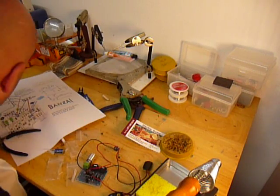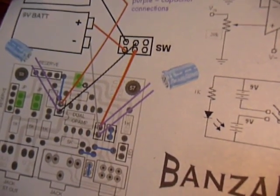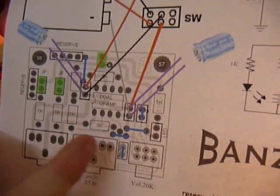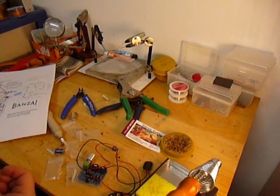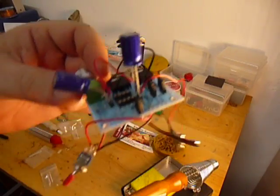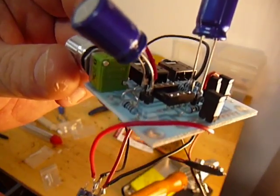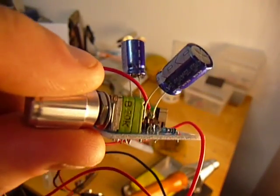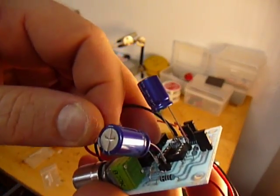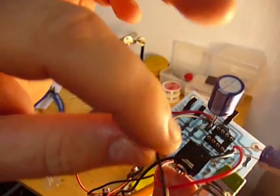On the diagram, it shows you plus and minus. You want to make sure the white bar on the side of the capacitor — that's the negative — so both bottom poles on this are negative. I'm going to add those now. You can see the capacitors have been soldered onto those jumper connectors. That white bar on the capacitor is going to match to your black lead on the battery — that's the negative side of the capacitor. Make sure that both sides have that white bar matching up with your black wire for the negative.